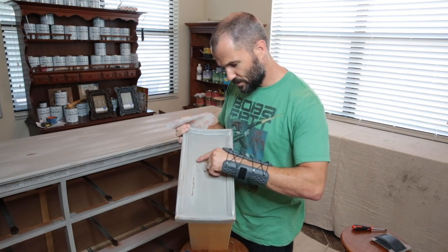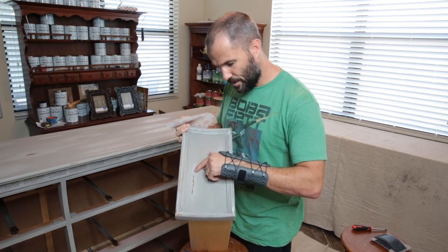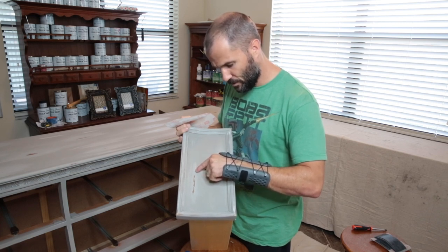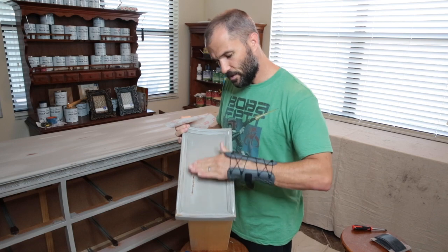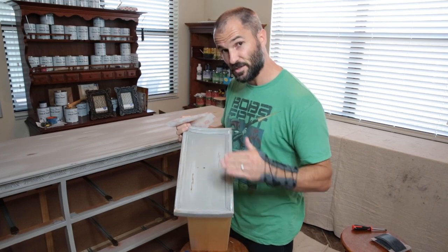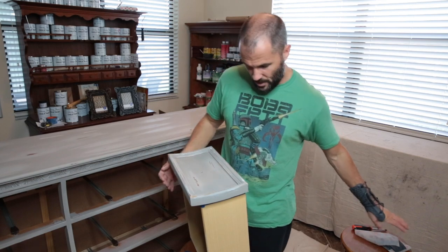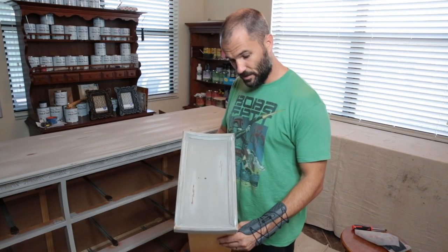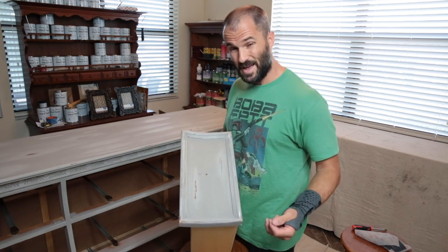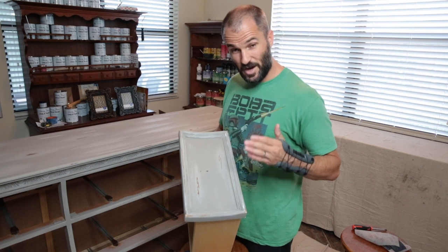The French linen when you sand it gets lighter, so there's a gradual transition from the darker base coat through the partly sanded down to the deeply sanded — no big divots or scratchy look. You don't want it to look scratched; you want it to look distressed. So blend it together. I do this outside; if you're going to do it inside, keep a vacuum cleaner handy. My trick is to use my leaf blower — I take the piece out front, do all the distressing, then blow all the paint dust off out into the yard. It really works great.